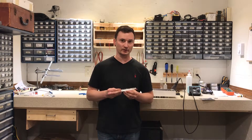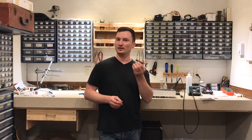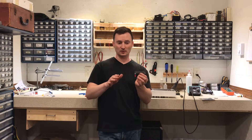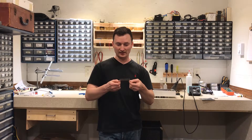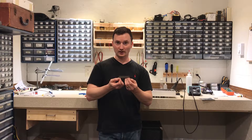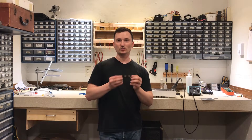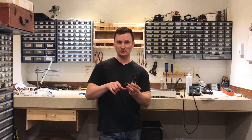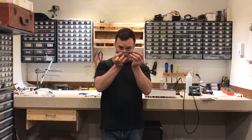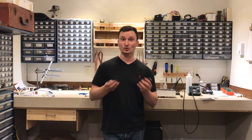For now, I can show you the solution I came up with for replacing those turret strips. These are the terminal strips I had originally ordered for this build. The problem with these is that both ends have to be bolted onto the chassis, which means they're grounded — and you can't even use them as a ground, otherwise you create a whole bunch of ground loops and get noise that way. So if I had bolted these onto the base plate and not used the end terminals, I wouldn't have had enough terminals to do the build. Also, when you put two of these side by side, you end up needing two screws side by side, which would have made it very difficult to form the relief in the base plate, especially right next to a tube socket.